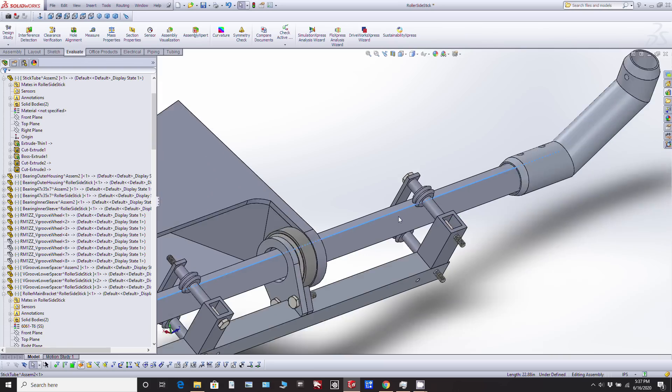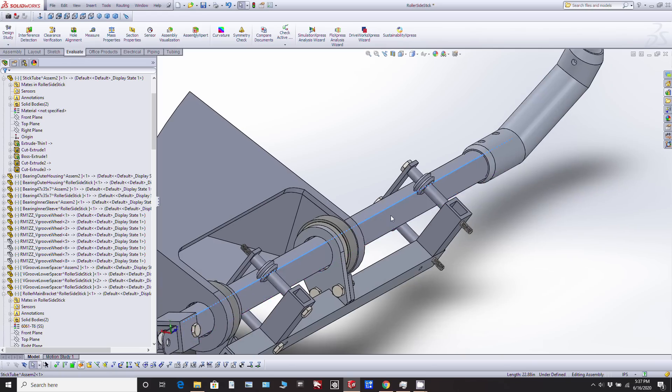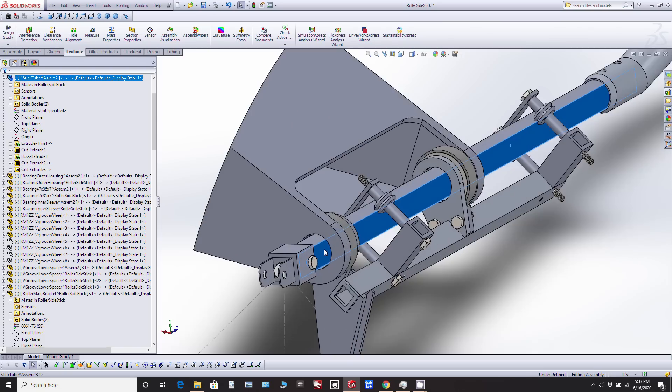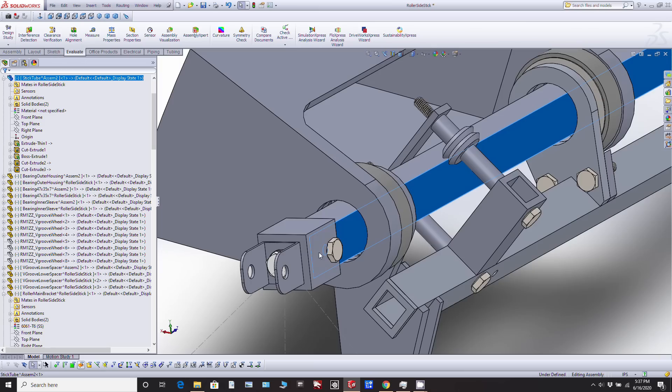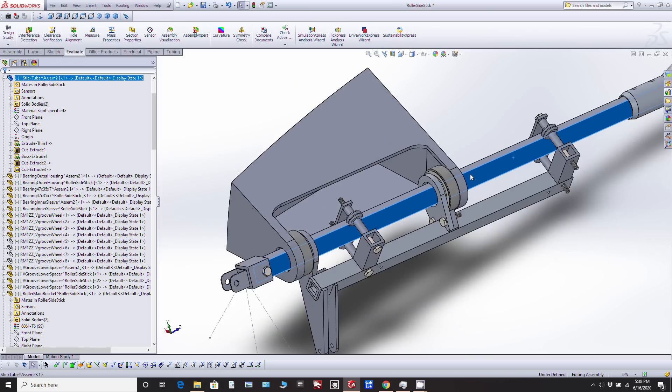So the options are just to stick with the 6061 and get a couple of extra pieces. Because it's just a square tube with a couple of holes in either end, changing it out is really not a big deal — it doesn't require welding or anything fancy. Just replace that square tube with a new one with holes drilled in the appropriate places. The other thing I'm going to do is see if I can source the same square tube in 7075 aluminum, which is even harder, so there's less chance of that happening.